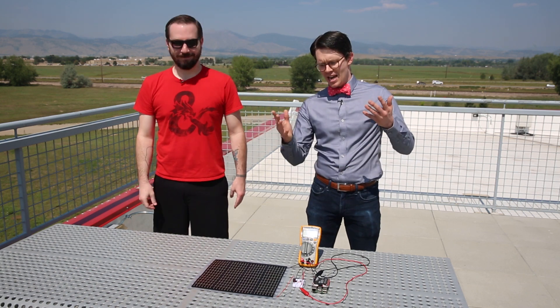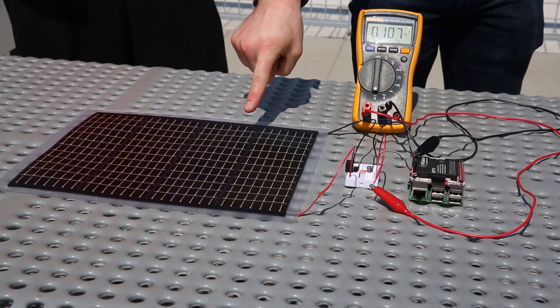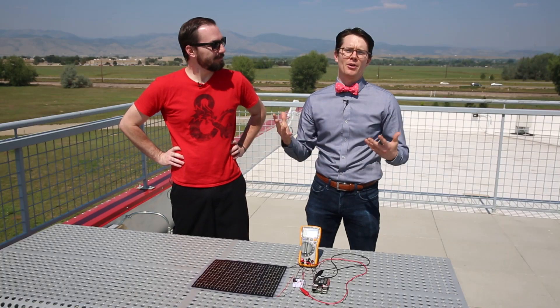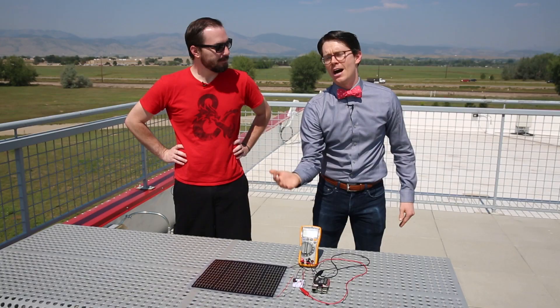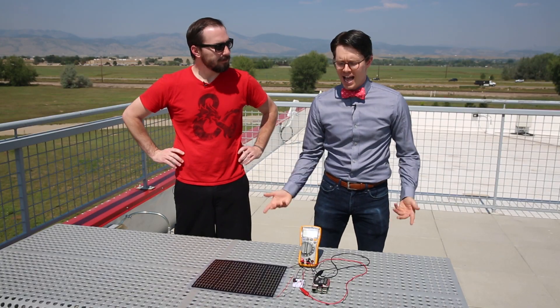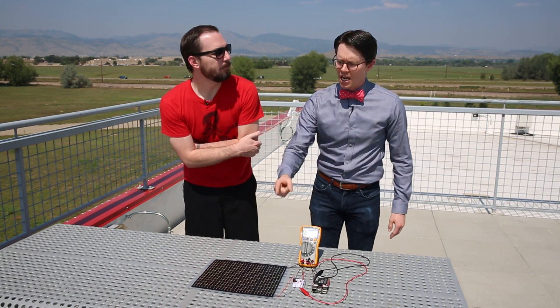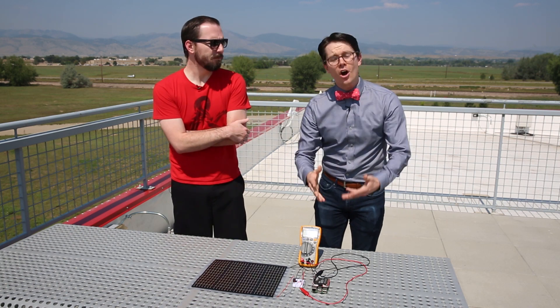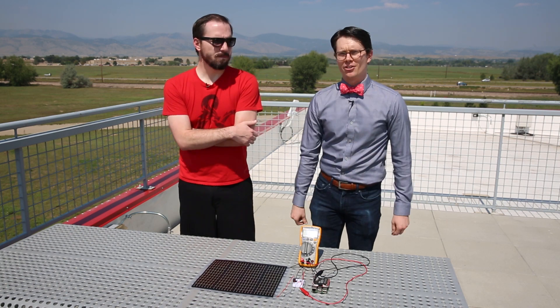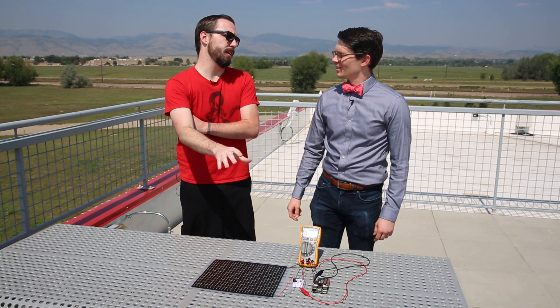What do we make, Sean? Oh, we made energy — just pure energy. This solar cell open circuit gives us about 19 volts, so I went ahead and constructed a very simple 5-volt output DC-DC converter, and as you can see we're getting about 112 milliamps coming from the solar cell after the converter into the Pi Juice. So we are actually charging the battery in that.